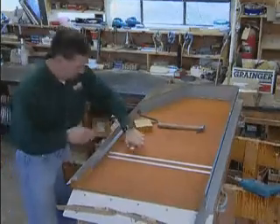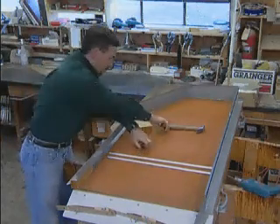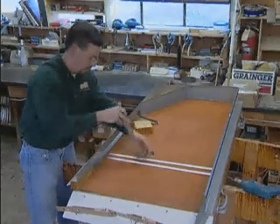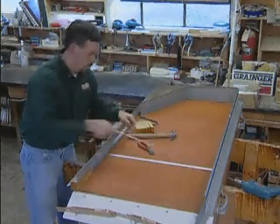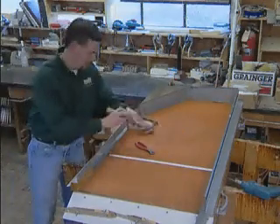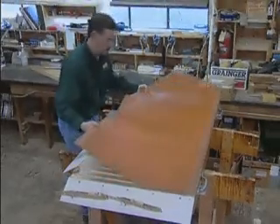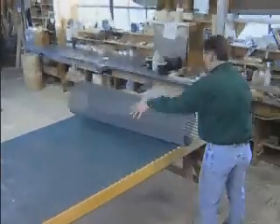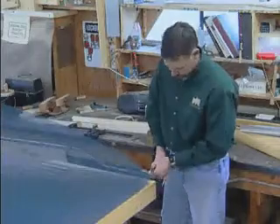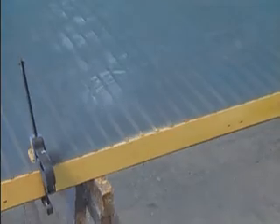Next, remove the horizontal metal pieces called riffles running across the top surface. It is preferable to replace all the riffles at one time. Even though some may look okay, the leading edge will wear thin and will crack when removed. When removing the overcover, do not damage the undercover. Place the deck on sawhorses with adequate light underneath. Always stretch the screen tightly. A pair of vice grips with large jaws works well.